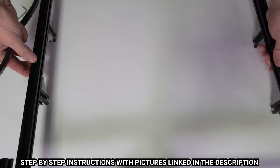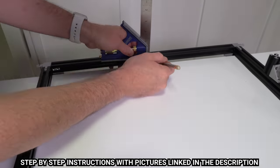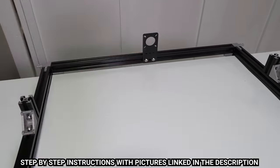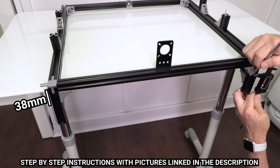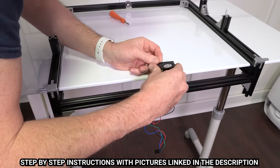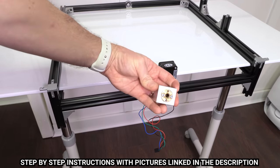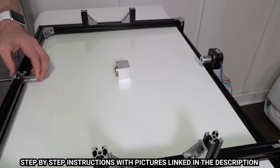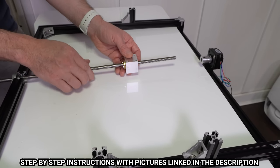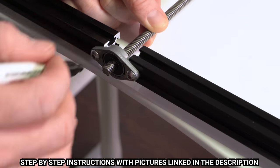Flip the entire shelf over and install the rubber weather seal onto the bottom of the side rails and the top of the rear attachment arms. Next, using the t-nuts that you installed earlier, mount the stepper motor bracket in the exact middle of your aluminum extrusion using the bottom two holes, then slide the rear cross brace down so that it's 38mm from the top of the extrusion on both sides and tighten it down. Attach the stepper motor to the stepper motor bracket using M3x5 screws, and then attach the lead screw nut to the mounting block using M3 screws. After making sure the set screws are loosened, slide the lead screw through the pillow bearing, screw it through the mounting block, and then into the stepper motor coupler. If everything went well, the lead screw should be perfectly lined up — but don't tighten the set screws yet because you'll need to mark the end of the lead screw where it comes out of the pillow bearing and then cut it to size using a hacksaw.